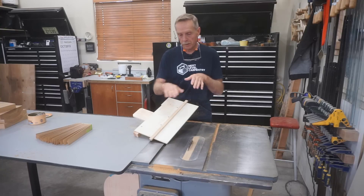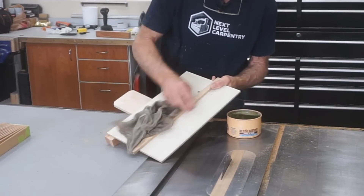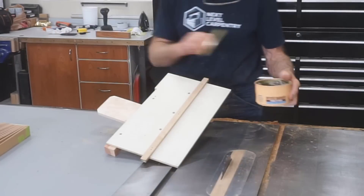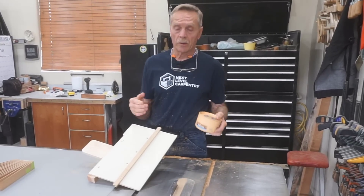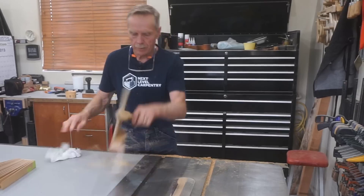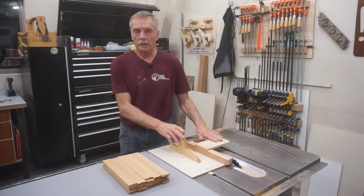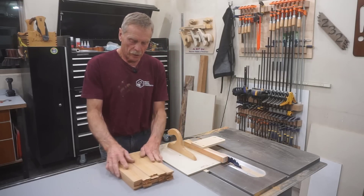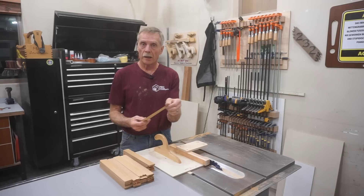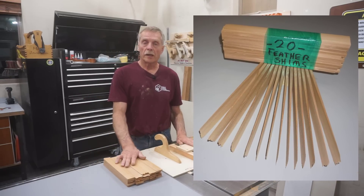Now I'm all set for a test drive with this 12-inch-long, nothing-to-5/16ths-over-12-inch shim cutting fixture. I flip the block over after each shim is cut to keep the work piece relatively rectangular so that the shims come out straight-grained instead of cross-grained. Partway through the process, the jig started to get a little sticky running over the table saw, so I took Johnson's paste wax and wiped down the bottom of the jig, the jig runner, with a liberal coat of paste wax — that helps it slide real smooth. But then when it's sliding smoother, I use extra caution because I don't want a slip and an accident. There are 50 shims here that came out of one 2-by-12, 12 inches long — every shim has a feather-thin end for precise work and is 5/16ths on the other end.